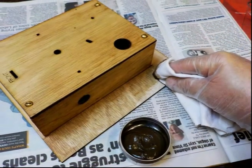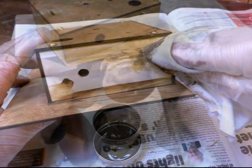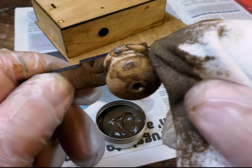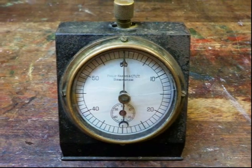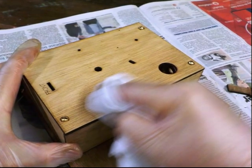Now repeat the polishing process. It's well worth applying several more coats of polish, as the colour of the wood will darken and you'll end up with it having a lovely sheen. Just remember to wait at least 2 hours between buffing and applying the next coat.